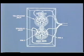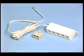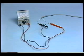If a customer requires more than one Starbus extension in the vicinity of a wall jack, additional wiring is not necessary, since Starbus mixes all data conversations onto one channel and separates them later at each user extension. You can expand one jack into many individual user extensions using ordinary telephone splitters. Unlike telephones, each attached computer, printer, or peripheral will have their own private extension name and number.